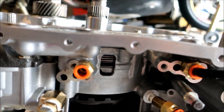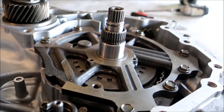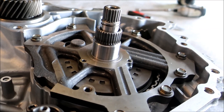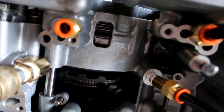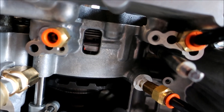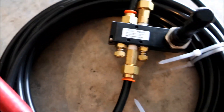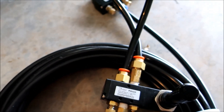I'm going to operate the clutches. You can't see the forward clutch operating but you should be able to hear it - just a little dull thud. That other thud is going to be the reverse clutch. You can see the reverse clutch operating through here. That piston moves the clutch back up, and whenever I move it to the forward clutch it automatically releases air through the exhaust port on this control valve.